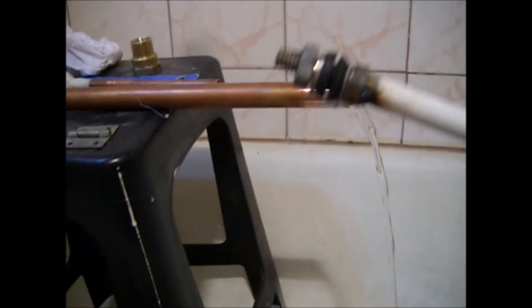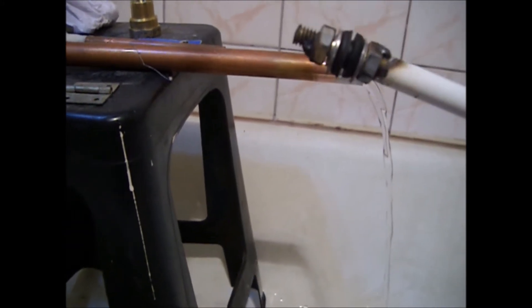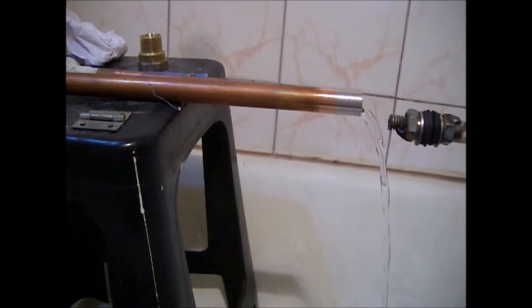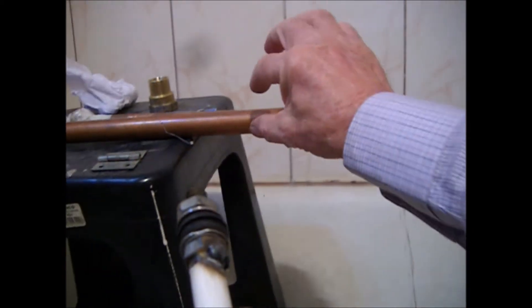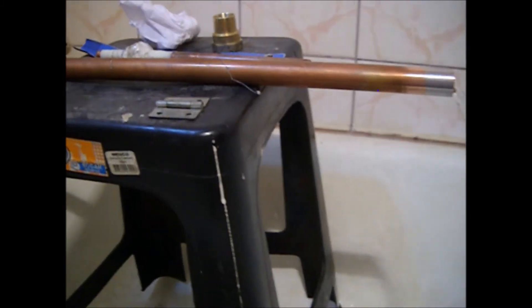Another alternative is the tool our colleague saw — this is the water blocker, one design of this kind of tool. We slide this tool into the pipe, jamming the flow. We block the flow by turning the nut and squeezing the rubber ring. The ring expands and seals the pipe, as we can see in this video.